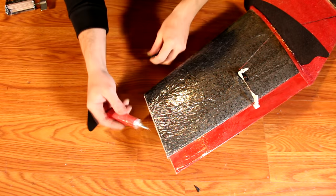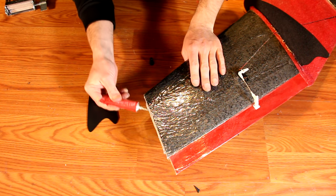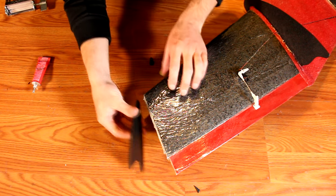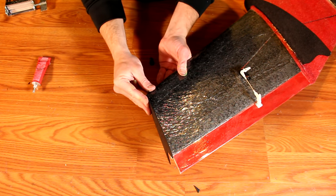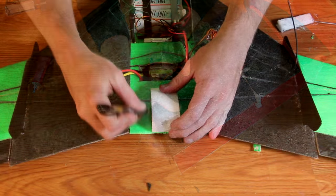The winglets on this airplane are simply glued in place. Add a good bit of glue to the outside of the wing and then press the winglet into place. Move it around, then remove it. Once the glue is approximately dry — about 15 to 20 minutes later — simply press it back into place and it will bond.